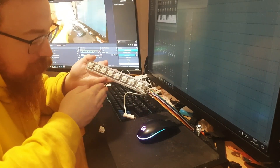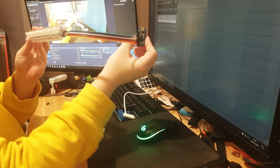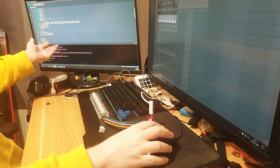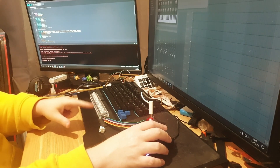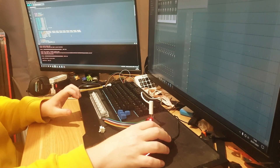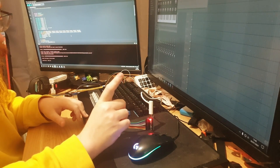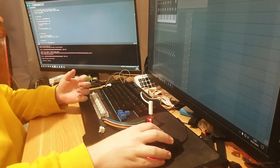Slightly different angle, but there it is assembled. Very nice. There's the Pro Micro on the end, all the wiring — very nice and neat. Plug it in. This is the code, which has been slightly modified from an example sketch to add an extra button and add pitch sensitivity for any potentiometers you also want to attach to the analog pins available on the Pro Micro. That's basically it.